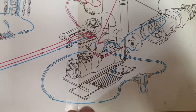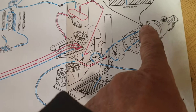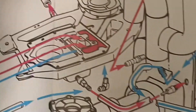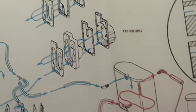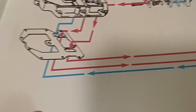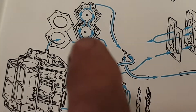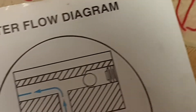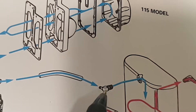Here's the water flow diagram in the manual — I'll move it slowly so you can see it. Water comes through the jet pump, then circulates through the filter I showed you, then goes up through the bottom of the muffler. All the stuff I've assembled here is clean because we built it. Then there's that T-fitting I was showing you on the back of the engine, and it goes to that fitting up on top that is notoriously plugged.